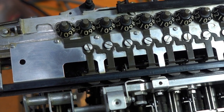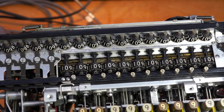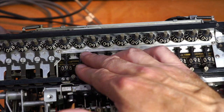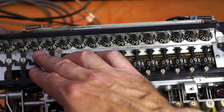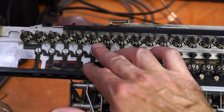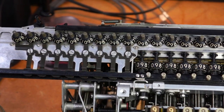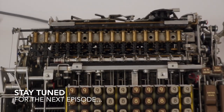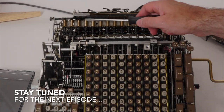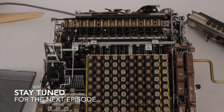My bell works again, because it's only sensitive on the last digit that's over the last transfer. So now that I am in the home position, if I do minus one — ding! And those are my spring transfers 13 and 14 — they all work. We can hear our warning bell. I definitely learned a thing or two, and I hope you did too. Now it dings correctly. Interestingly, multiplication with large numbers works, but if you want to do an addition, it only works up to 14 more digits than the current position of the carriage.